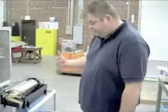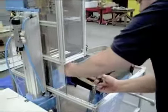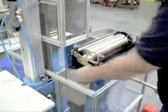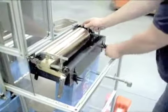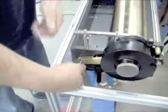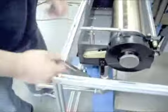To disassemble the glue box off the Casemate 2.0: grab the handle, pull the rack out between the gears and the pusher. You want to flip — you have to push this forward a little bit, then flip all the little clasps. Then take out these shoulder bolts — you have one on either side.